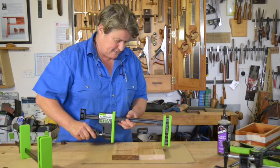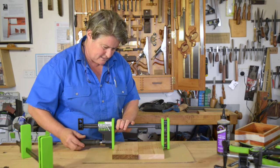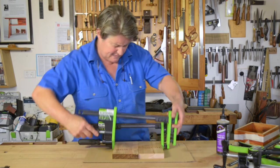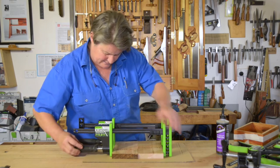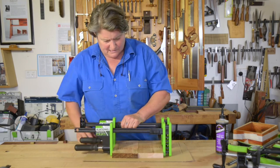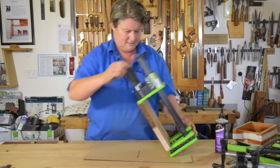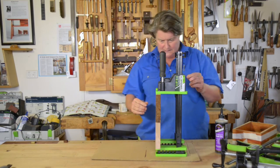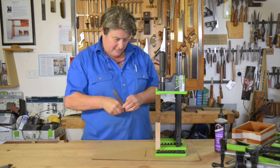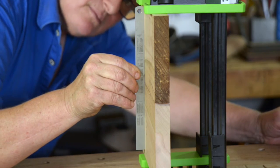The clamps are already at the right size and I'm now just applying a little bit of tension. I don't want to put a lot on because things slide around — as I said, as soon as you approach with the glue, everything goes to hell. One of the things that's really nice about these clamps is I can actually stand the work up and have a good look at it. By that I mean I can check it to square, check if the work is sitting nice and true and straight, which in this case is pretty good.